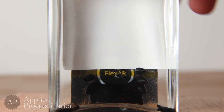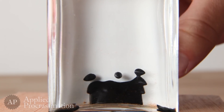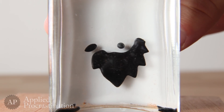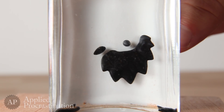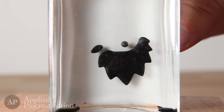One application I can think of for such an actuator is to make a ferrofluid music visualizer, which is an idea that's been very popular on YouTube and Kickstarter lately. In that scenario it's not even necessary to tweak the permanent magnetic field to not lift ferrofluid on its own, because it's more interesting if you have a bigger blob of ferrofluid at all times. The only thing necessary is to modulate the permanent magnetic field with the adjustable field from the coil.